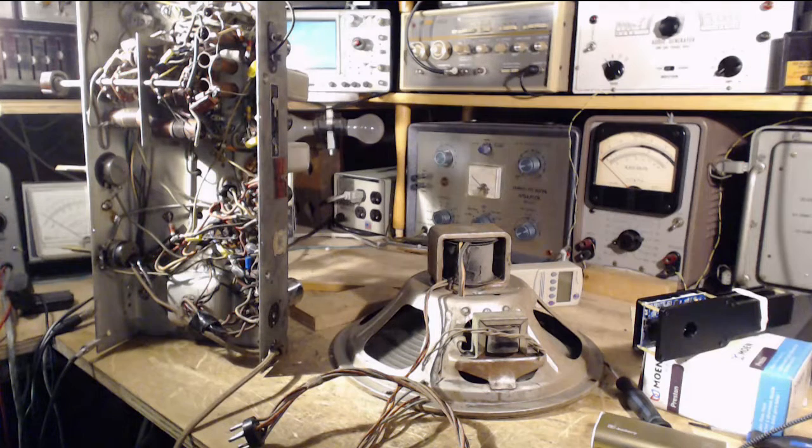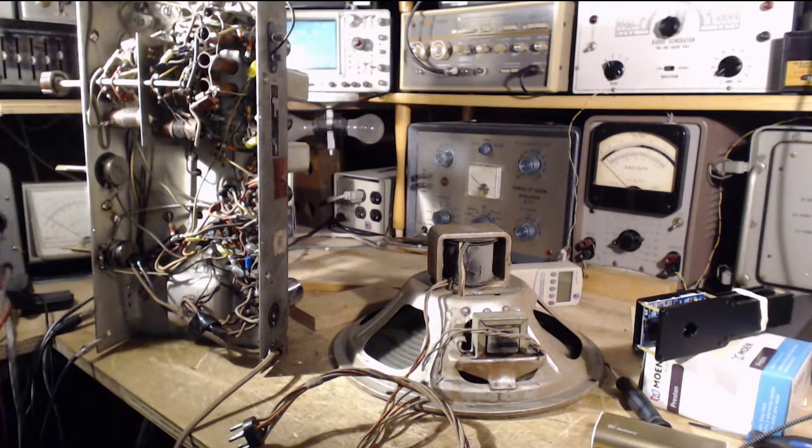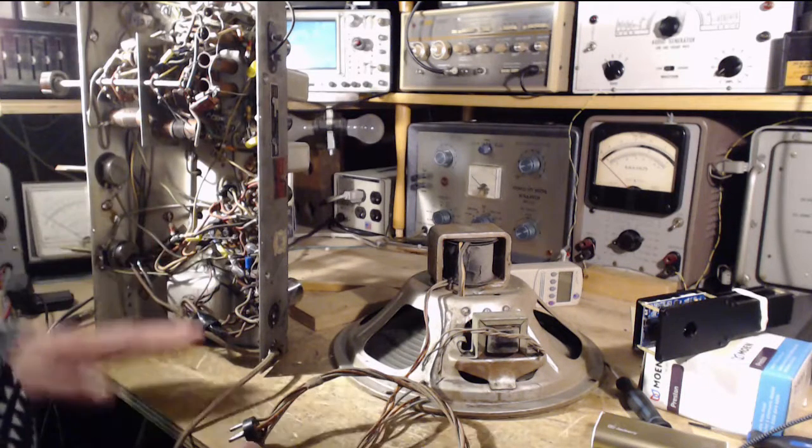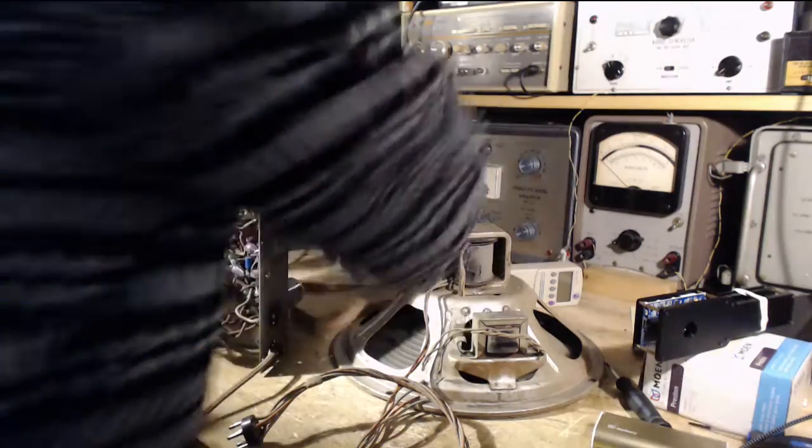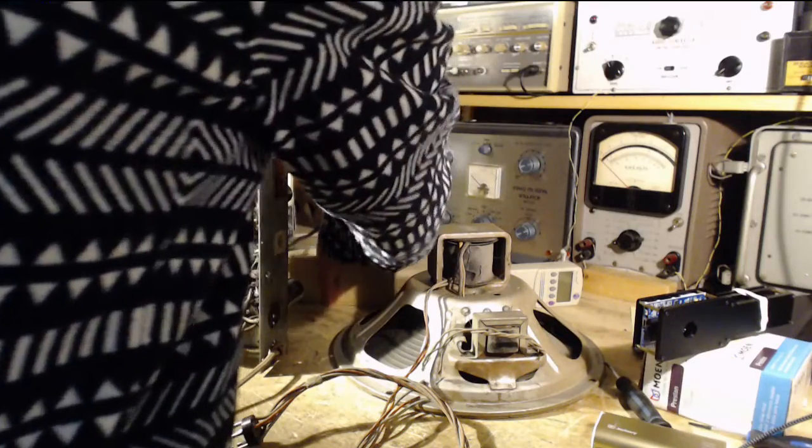But the fact is, we can operate the set without the audio output transformer working and all that stuff, and if we do need to hear it, I can tap out the audio and put it through some other amplifier. But actually, for an alignment, all I need to do is watch the AVC voltage. We don't really need to hear the radio,